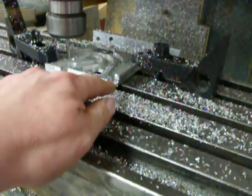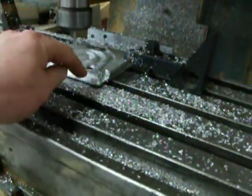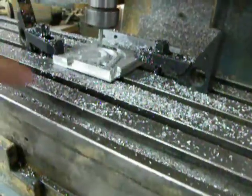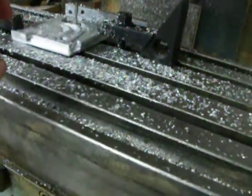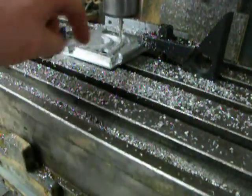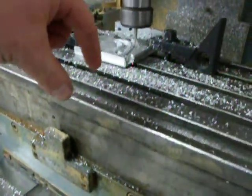I've done two cuts. The only way I've found to get a decent finish on one side — if you just do a plunge and drag, you end up pulling swarf. If you can have a wider gap with a smaller tool, then it produces a better finish.